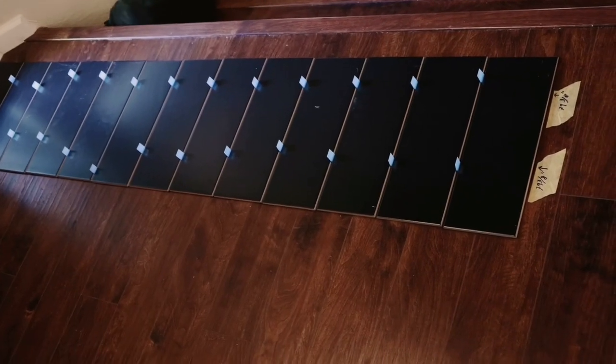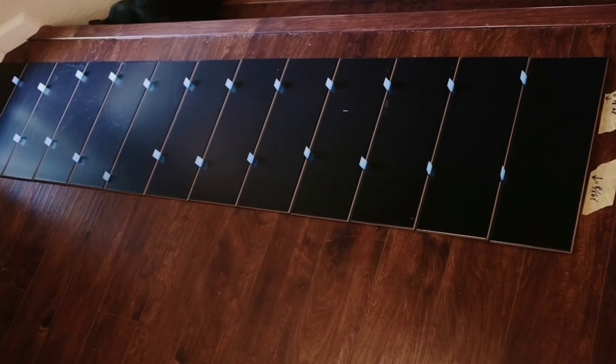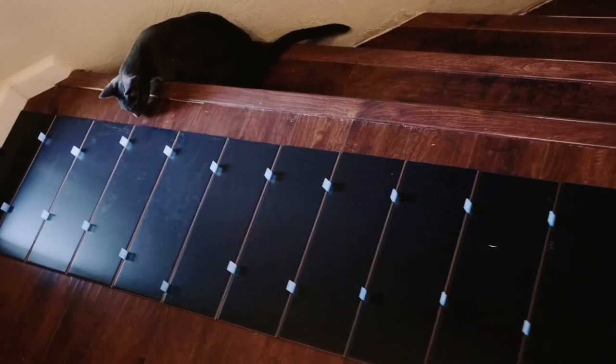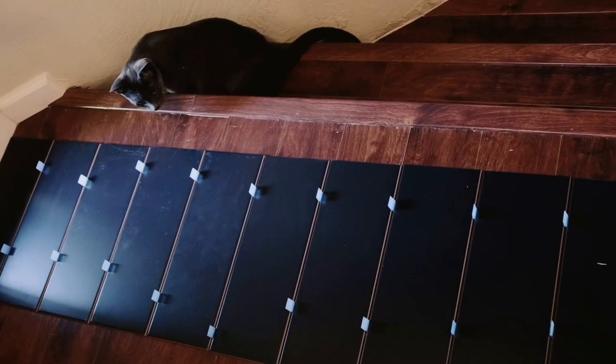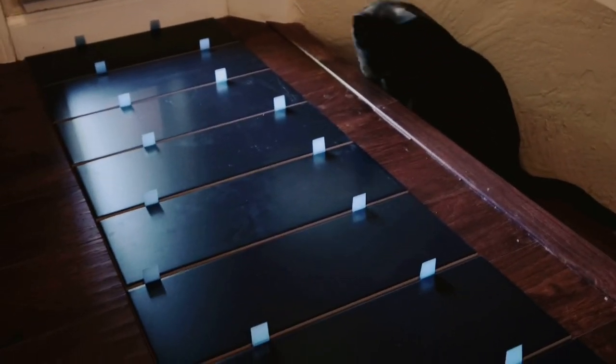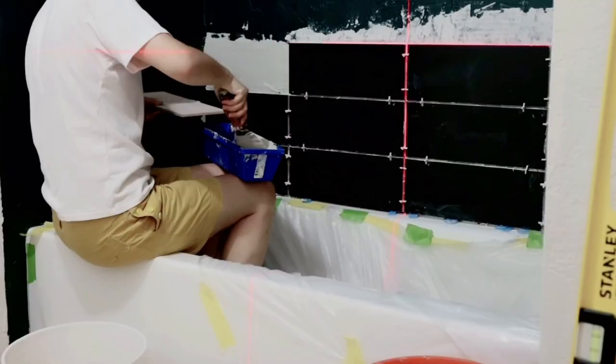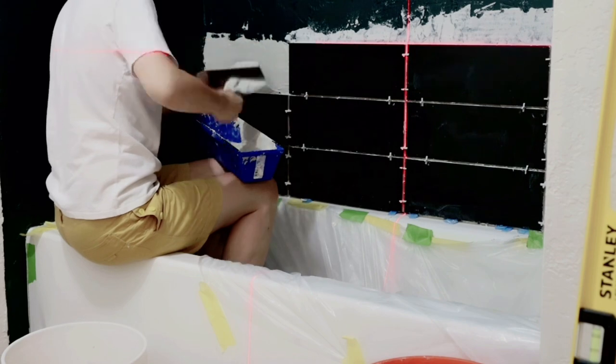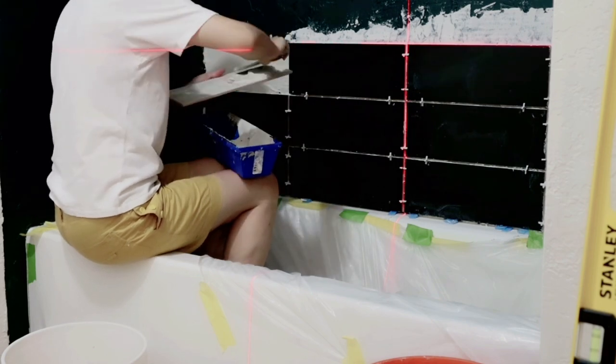For some reason, no matter how carefully I did the measurements, it's always not the same when I put the pieces on the wall. So I used a skill that I learned from elementary school. I taped the floor for the wall size, then laid out the tiles with the spacers on. That way it gives me the exact dimension to cut the corner tiles.